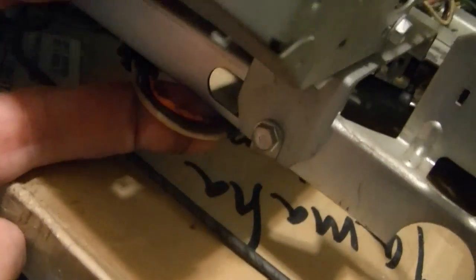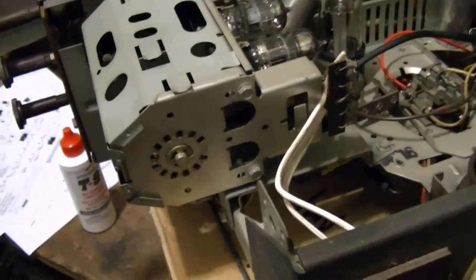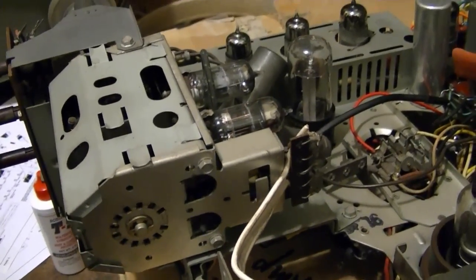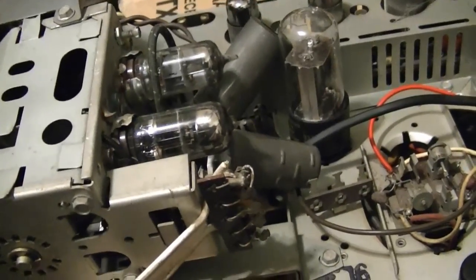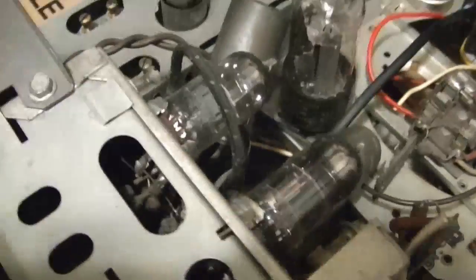Another thought is that there's only three wires going into the tuner: B+, which I'm pretty sure is the orange wire, filament, and AGC — automatic gain control, which boosts gain when you get a weak signal. I doubt AGC is really going to be an issue. B+ could definitely be an issue — if there's no power going through to here, it's not going to do anything. One or both of the tubes could be bad — simple enough to swap them out. And finally, the output jack could be bad: there's a piece of coax coming out of the IF box that goes to an RCA plug, but the jack inside the tuner might have an issue — though that seems a little unlikely.